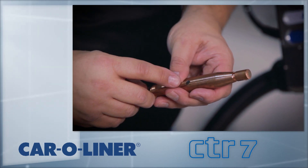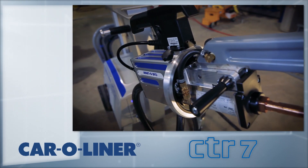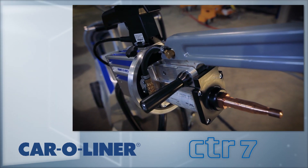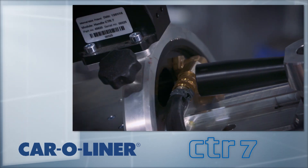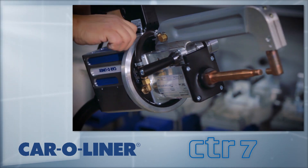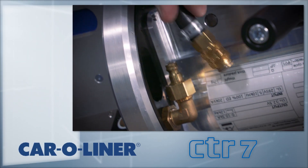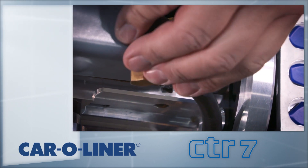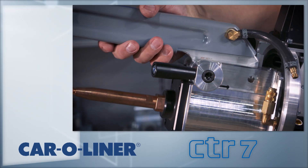Always make sure that the beveled edge of the cooling tube is inserted first. To change the C-arm, hang the gun on the welder and hit the coolant button to turn off the pump. Loosen the locking handle on the swivel ring and rotate the gun so the arm is facing up. Disconnect the cooling hoses. Unlatch the retaining clip from the hinge pin by sliding it up. Turn the locking handle 180 degrees and lift the C-arm.